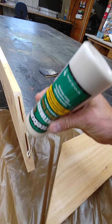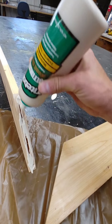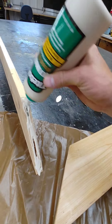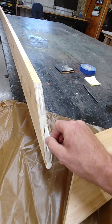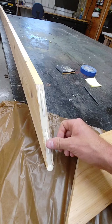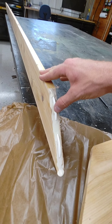You're going to want to add some exterior wood glue — the more the better. I realize that this glue probably won't stick to these composite biscuits, but I still think it's good to use these rather than the wood ones, just in case you don't want them to rot out.